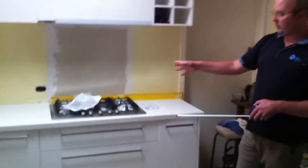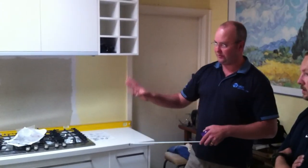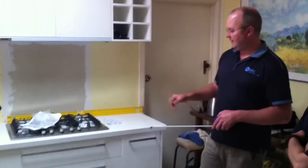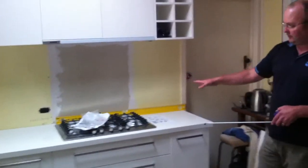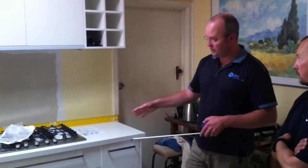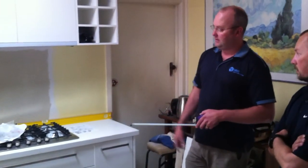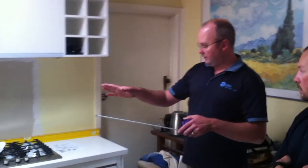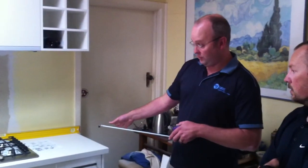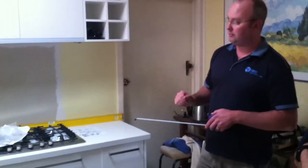So basically, when I first walk in, once I've established that all the jobs are ready to measure, arcs are on, benches are in, power points are in position, then I can check measure. I'll always start with the bench first, and I'll level off the bench. And if there's a 2 or more mil run out, then I'll create that shape in the drawing, and then I'll measure up for my heights. And if the reference point from there to there, being 2 mil rake, corresponds to the height left and right, then I know the overhead's a plumb.